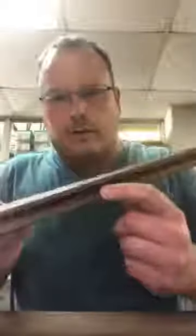As you can see, it's got a little groove in the side for hidden fastening, and there's a little clip that you use. They come in a jar like this, and inside the jar you're going to find metal clips. There's a little hole in them — that's where the screw goes, down into the joist at about a 45-degree angle. You fasten the board by inserting the clip into the groove in the side of the board and screwing it in. The next board goes onto the clip and locks together, creating a nice groove down the middle, giving you automatic gapping between the boards, allowing for some movement, and eliminating screw holes through the top.